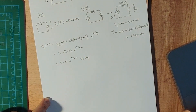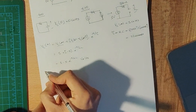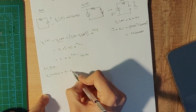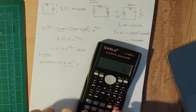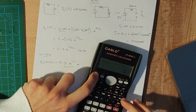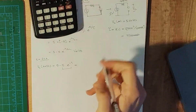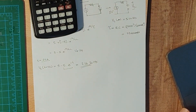The first question asks for the voltage across the capacitor at the time constant. Our time constant is 22 seconds, so VC(22) = 5 − 5 × e^(−1). Calculating 1/e ≈ 0.36, multiplying by 5 and subtracting from 5 gives us 3.16 volts. That's the calculated value — we will also measure it.